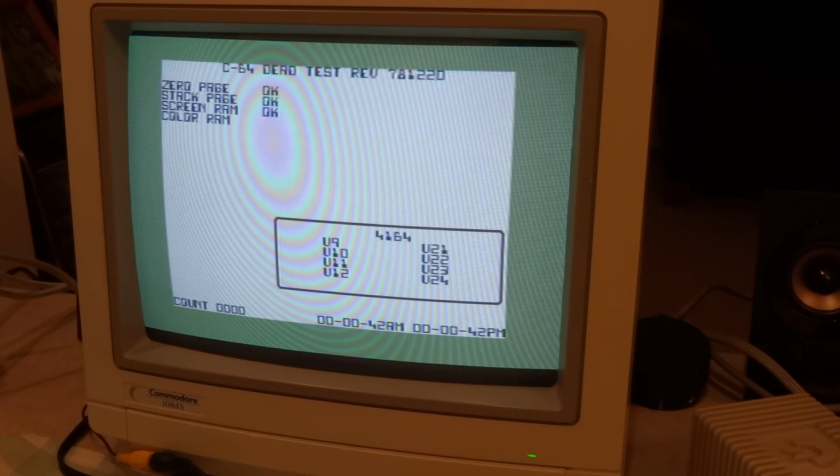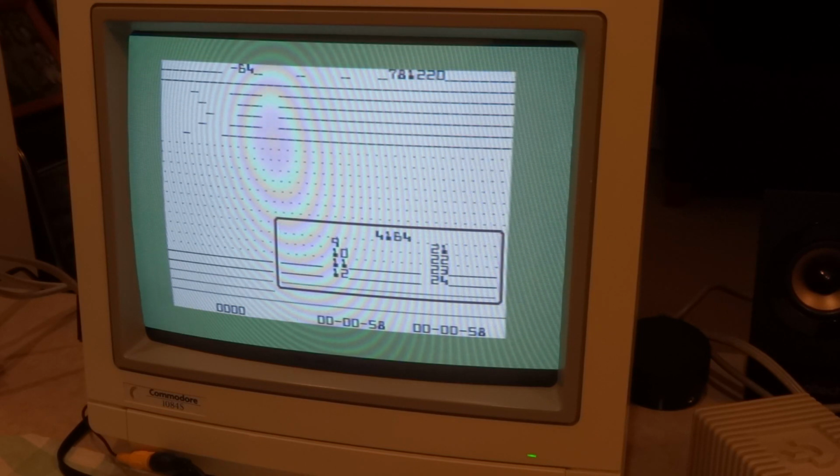Okay, let's see if it is the chip. If it still does the same clicking but hardly audible part, like the first time, then I know it's not the chip. It's something to do with the audio output circuitry, which I would have to look at later. And I do have schematics available if we have to get to that stage. Let's keep our fingers crossed and hope it's just the chip.